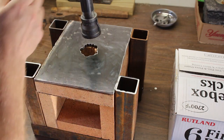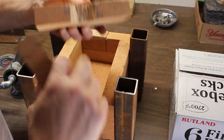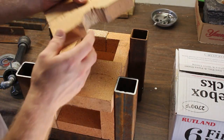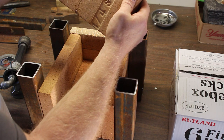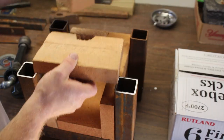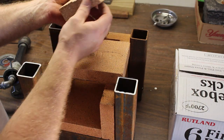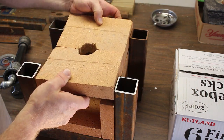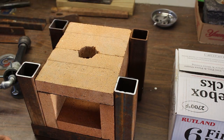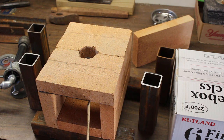The reason I have that quarter-inch plate is so I can mount the burner on there and weld it in place. Below this, I used a masonry blade on the angle grinder and ground out as much as I could, trying to get as close to a circle as possible. These bricks I also had to cut using a tile saw blade with a skill saw so that they would fit in. Dimension-wise, the opening is about four and a half inches wide by three and a quarter tall by nine inches deep.